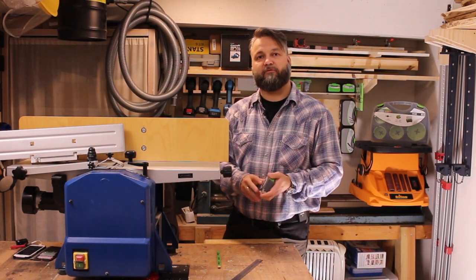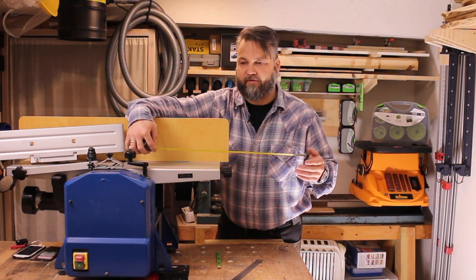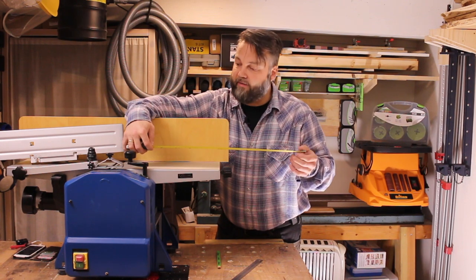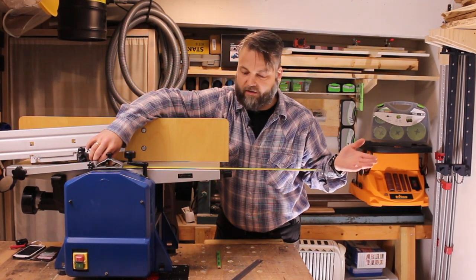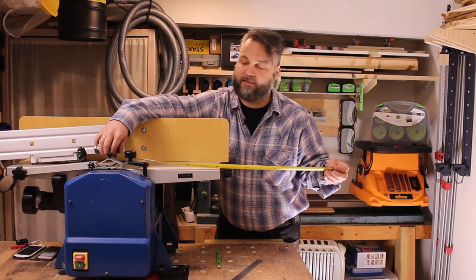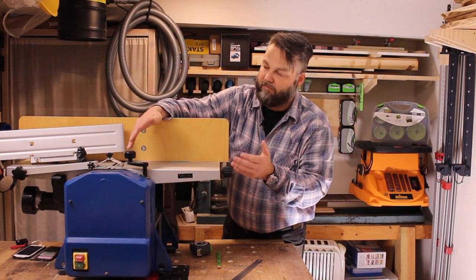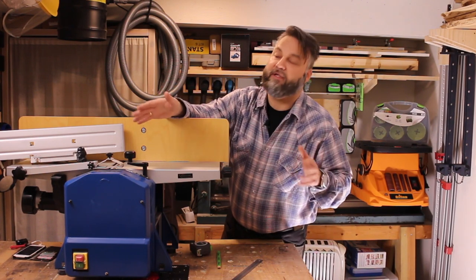This is clearly a product meant for the DIYer and consumers, and I want you to be aware of the limitations — not specific to this machine but to this kind of machine. Realistically you can only get good cuts with boards up to twice the size of the bed, so that's 28 inches or about 70 centimeters given a 14-inch bed. I've done boards up to 130 centimeters and struggled getting the bow out lengthwise, but that's a limitation that pertains to all these kinds of machines.